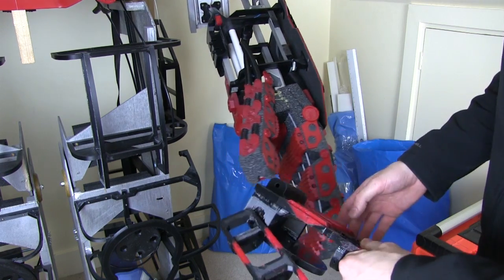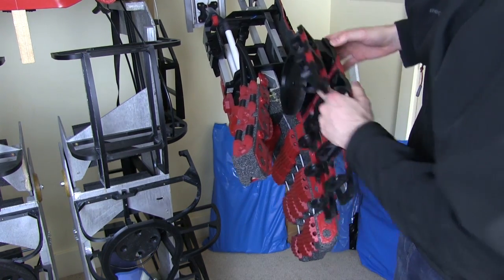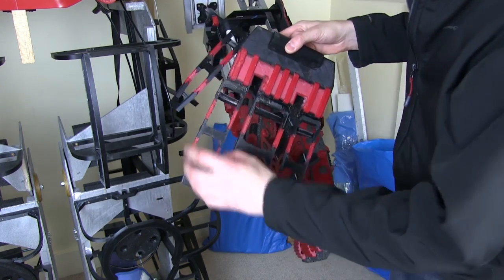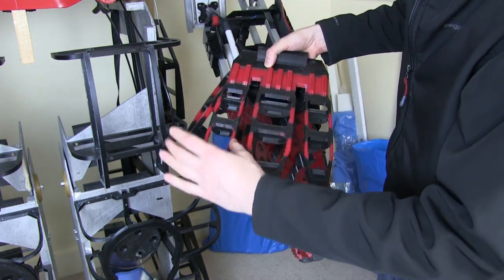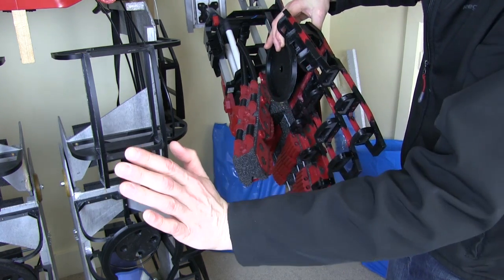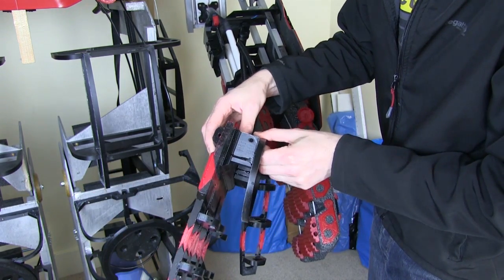Here is the existing left hand, and here is the replacement. It's about a finger-length shorter, much more stumpy with three fingers, not quite as wide, and the thumb is set back quite a lot more. The repulsor sits in the palm. The fingers look flat right now but will be covered with rounded shells for each finger section, hiding the pull strings. The hand plate will cover the hinge at the base of the fingers and needs to slide backwards to allow the hand to tilt — the typical Iron Man thing — to reveal the repulsor. We've got two hinge points that allow the palm to flip as the hand plate slides back.